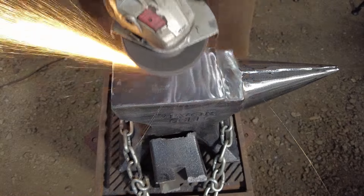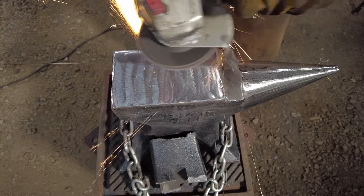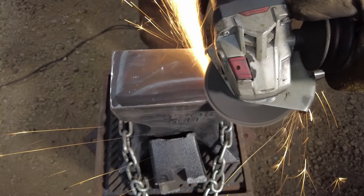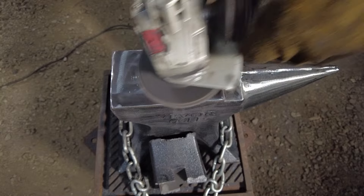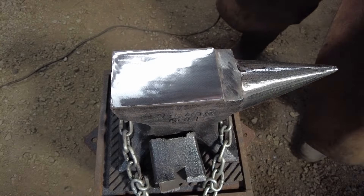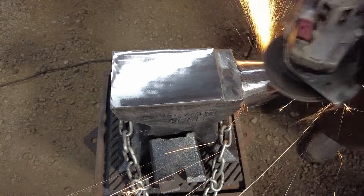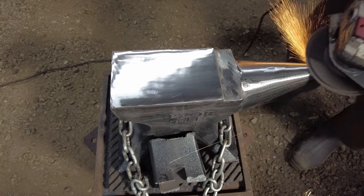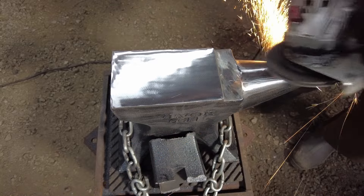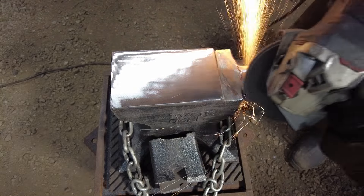The flap disc I'm using is just a 60 grit flap disc. I used that to shape up the profile of my edges and also to go in that crisscross pattern again on the anvil face and horn, working down all the roughness created by carving with the stone wheel. A flap disc is really great for that because it has some give, unlike a stone wheel — it contours better to surfaces and leaves a much nicer, more even finish. While I was at it I also cleaned up the step — it was rough from the factory, so I cleared that up too.